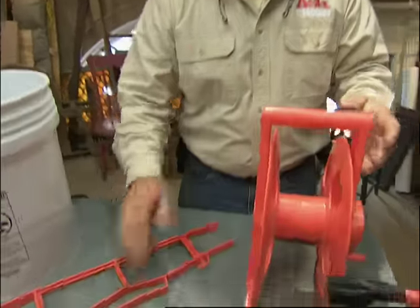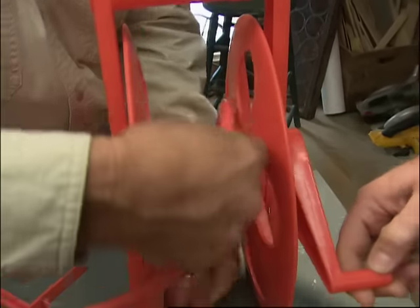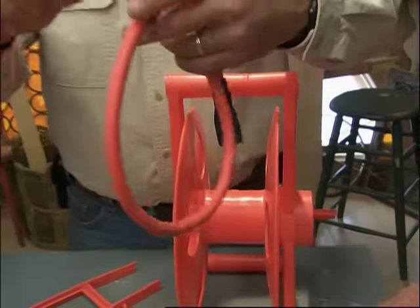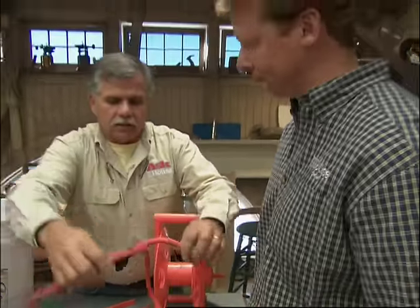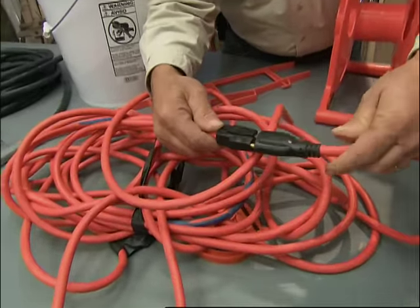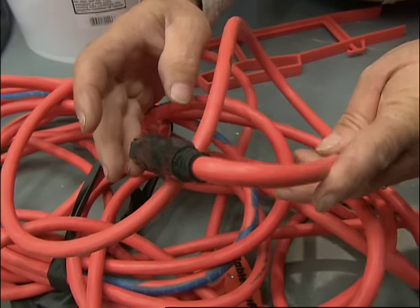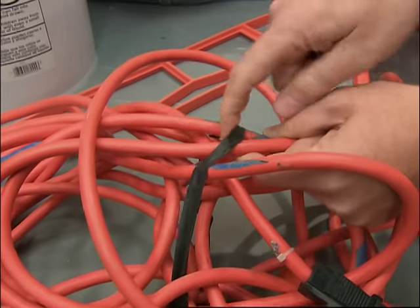I would say that cord was wound too tight. There are all kinds of gadgets out there that do that — gadgets like this coil, which is one I don't like. When you wind the cord on there, look at how tight that is. When you unwind it, it's created a memory so the cord won't lay flat on the floor — it's all bound up like a spring. It can also cause damage to the wire. People will plug their cords together like that, and it puts stress right there, damaging the wire inside. Here's another no-no: we don't want to ever store these with tape because it can leave glue behind, and we don't want that on the cord.